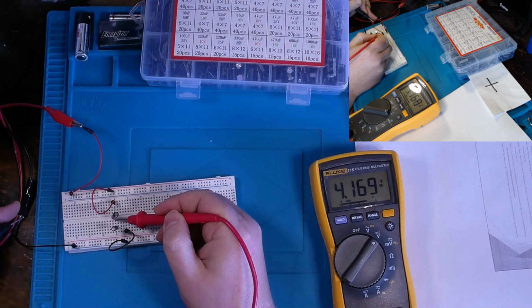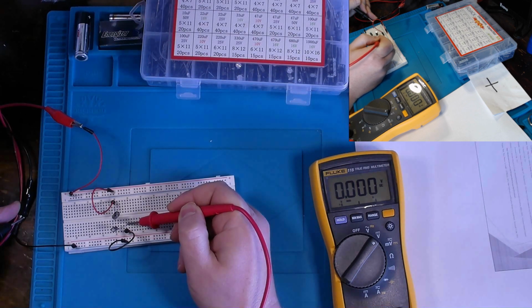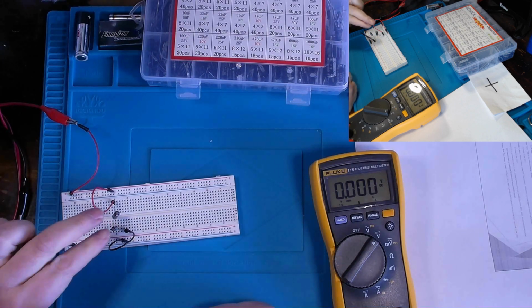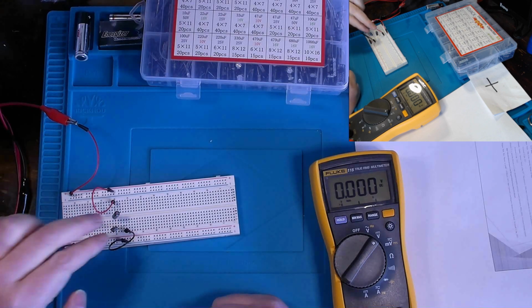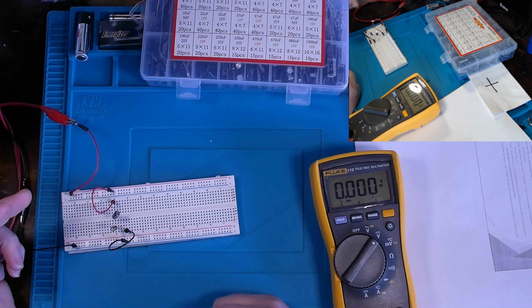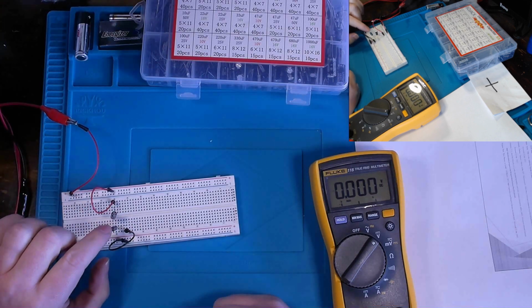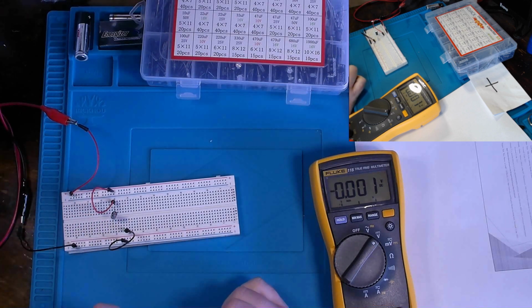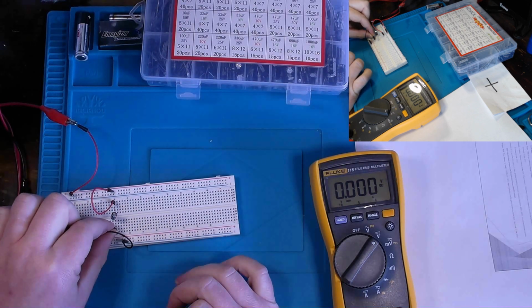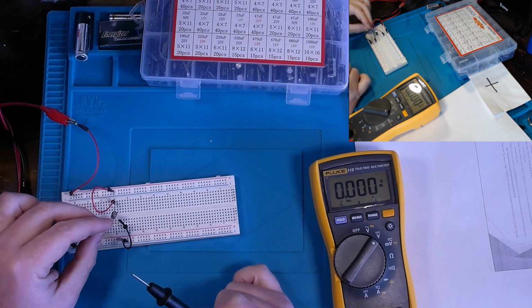5 volts. We're seeing a 4 volt drop across that capacitor, or a 1 volt drop. So we got 4 volts going to the second one, but we're still 0 out of the end of it. So I wouldn't say that you could use a capacitor to voltage divide anything, because you can't. Essentially, what's occurring is balancing the potential that's stored between the two. So if this capacitor was to store the greater portion of electrical current coming through, then this would have less to store, as we saw when we just had this removed and only this one in circuit charging it up. Letting it sit at that charge, and then throwing this other capacitor in.